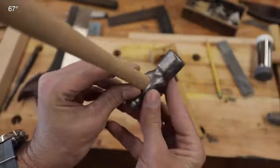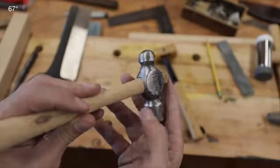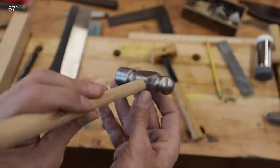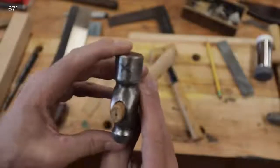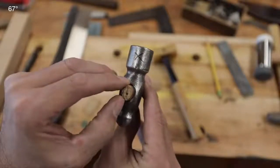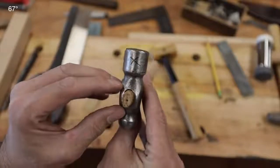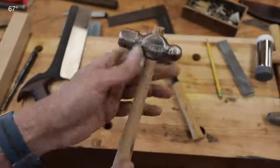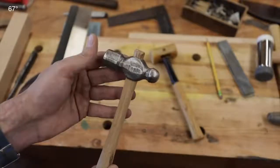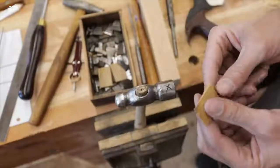That's what we're looking for. When you're working with cast or forged tools there will be inconsistencies — they'll never be perfect — but it is sitting hard on that shoulder right there. You can see how tight it is around the top; everything is filled up. Even the kerf we put in there is so tight we'll be hard-pressed to get much of a wedge in. This handle is just not going to come loose — it's seasoned wood from a warm shop with super low moisture content. If we wedge this properly, we're going to be in good shape.